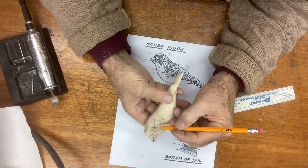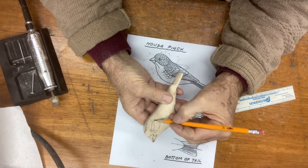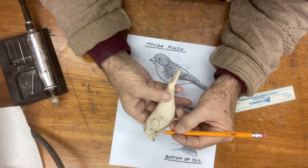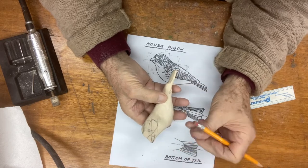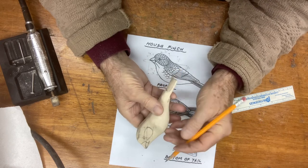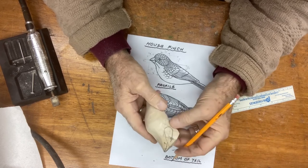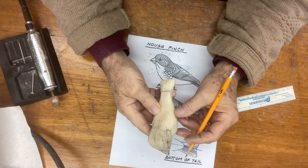From the eye I drew a parallel line to the beak line, coming back from the center of the eye to the back of the cheek — three quarters of an inch. From there I drew another perpendicular line through the beak line and the eye center line, measured down three eighths from the beak line, establishing a rectangle. Then I drew an arc with a tangent point here, swinging around to the tangent point here, and by the time you get up to the eye center line, swing it up towards the middle of the beak. That's done on both sides. I also came through the eye with a line forward — that will be an eye channel — and it swings down a little bit.